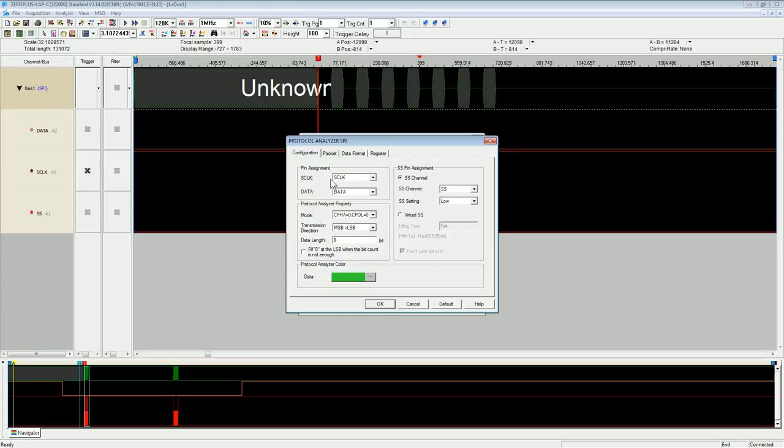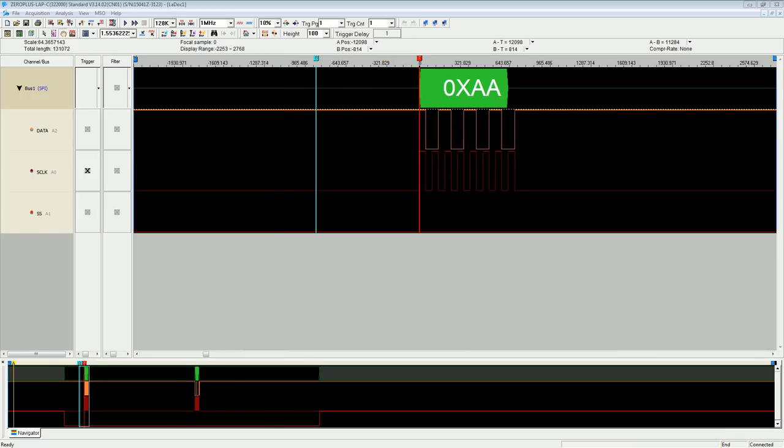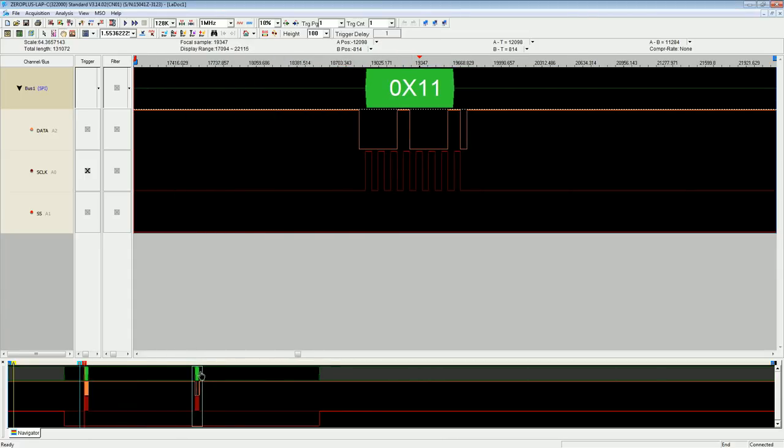And I think that's pretty much comprehensive for SPI bus, for example. And sure enough, if I do an SPI bus and execute, I'm writing AA as the command. So you can see that there's two down here. That's the command, and I'm writing AA hex. That is correct. And I'm writing the next data as 1-1 hex. So that is correct. No problems whatsoever.